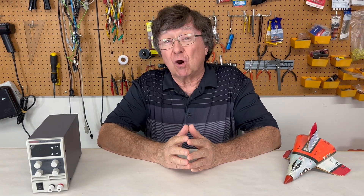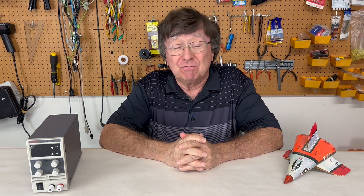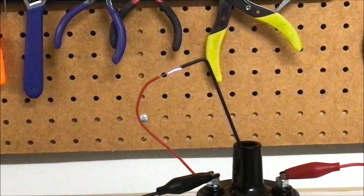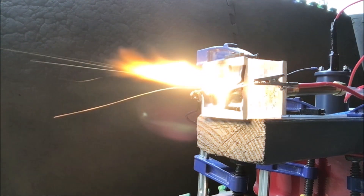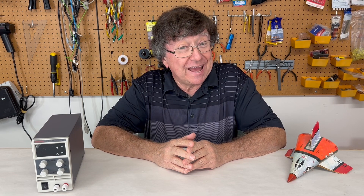To step up the voltage, we're going to use a coil — and we just happen to have one. The ignition system for our paraffin-potassium MHD rocket motor blocks uses a coil from a 1968 Volkswagen Bug ignition system. To that, we've added a tank circuit to drive it. Here is the system in draft mode on the bench, and here it is in action igniting a paraffin-potassium motor block. Instead of 12 volts like the Bug or our rocket engine ignition system, we're going to put 30 volts in to get a bit more bang out of it.